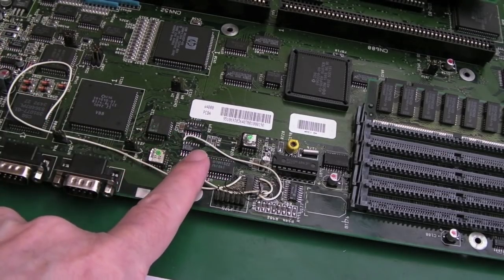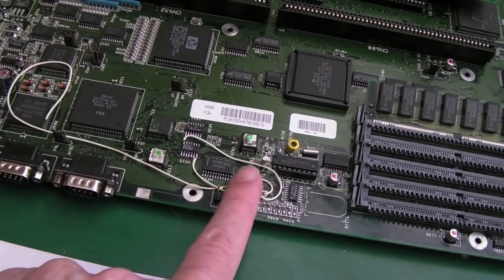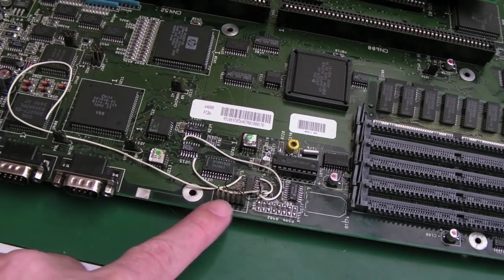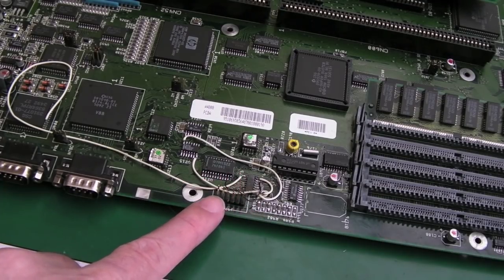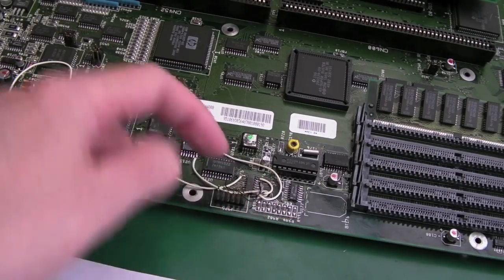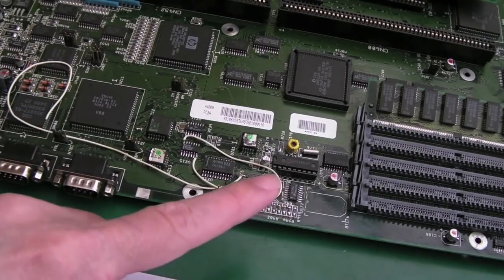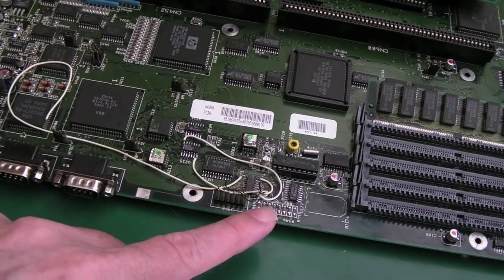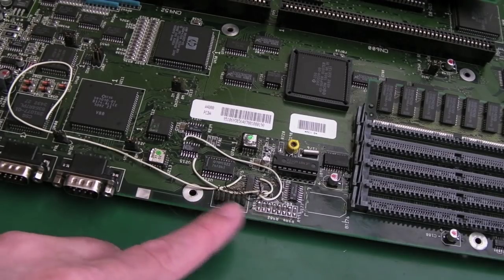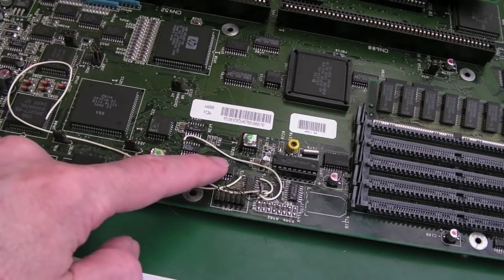So what they did, they extended it and read another 8 bits. Instead of just reading the 8 bits for the mouse, they also read another 8 bits, these jumpers here. Now you can see that there aren't enough jumpers for 8, there's 1, 2, 3, 4, 5, 6 jumpers. So there's 2 bits on that chip, and David Haney pointed out the first 2 bits are hardwired, so that's why we've only got 6 jumpers. So in theory it's reading 8 bits, again through to Lisa after it's read the mouse presumably.